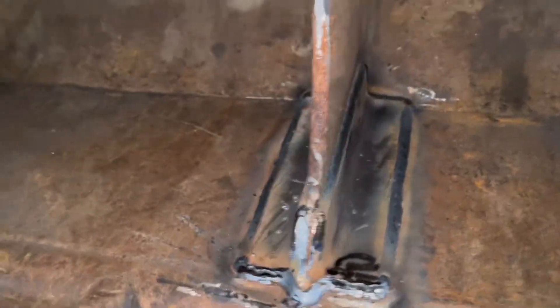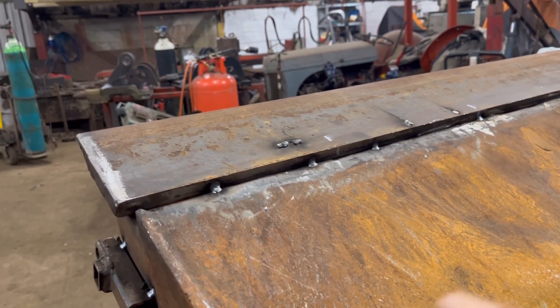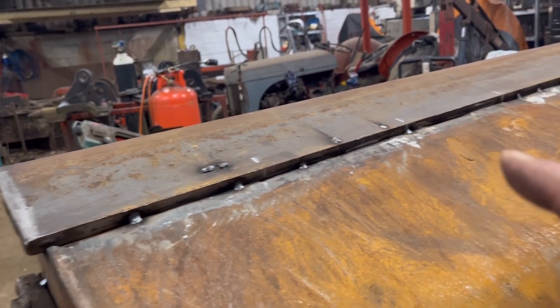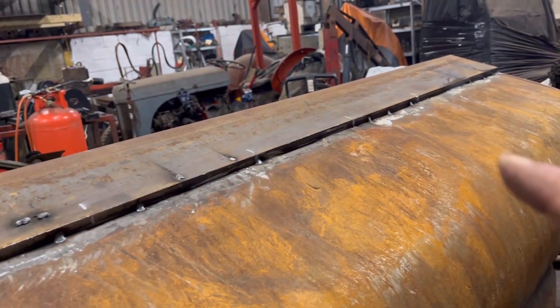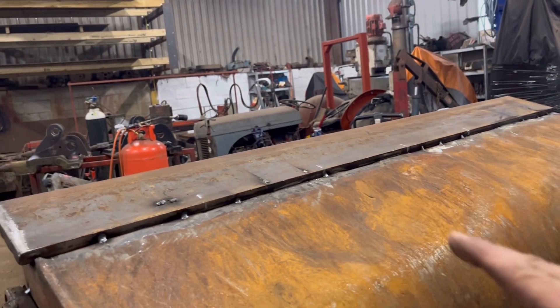So that's what I've welded in there now. I'm going to weld the edge on now. I've mapped out 10 inches at a time to do it, so that way the heat hopefully shouldn't make it bow.